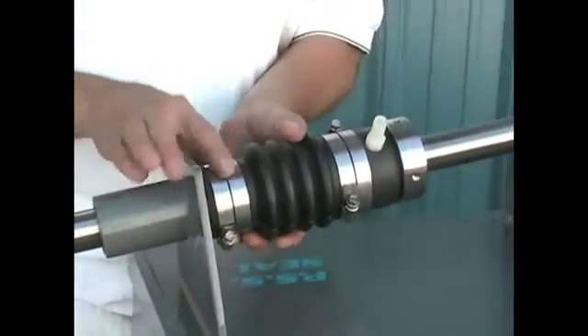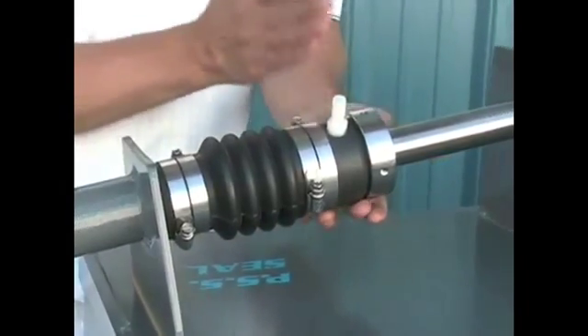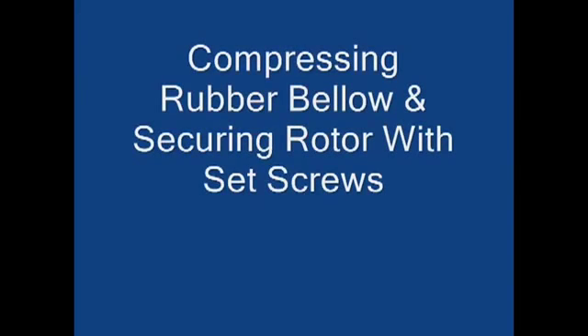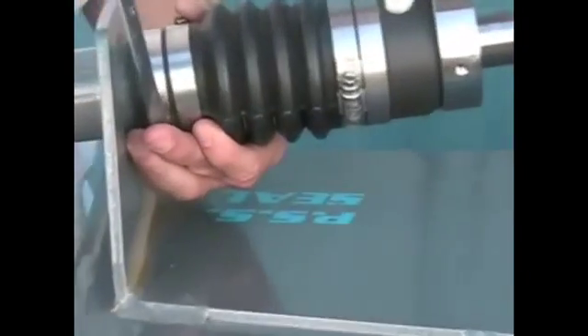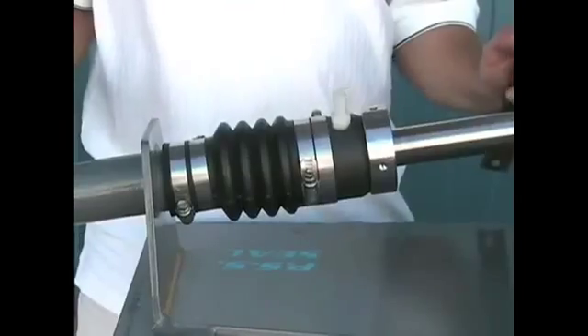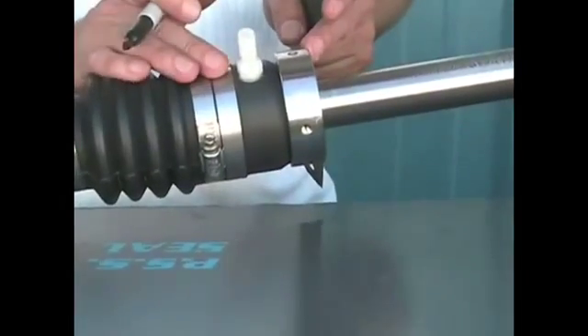You may also wish to position the bellow onto the stern tube to ensure that those faces are flat and aligned with each other. At this time you're going to tighten the hose clamps to secure the bellow to the stern tube. At this point, confirm again that the stainless and carbon are just touching or in their neutral position.